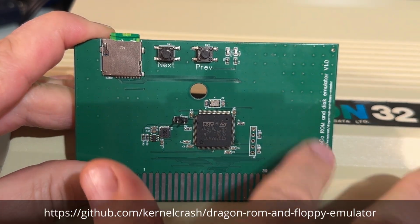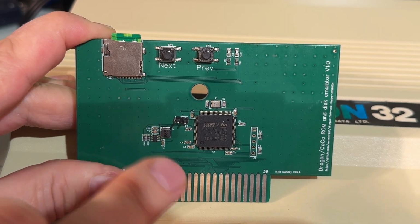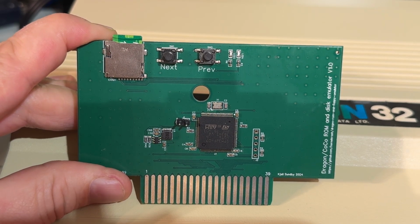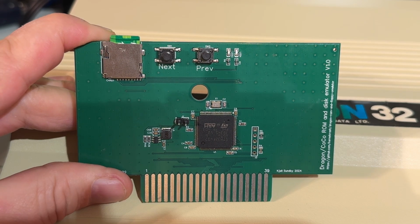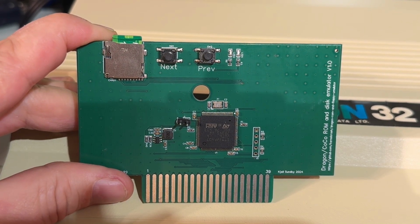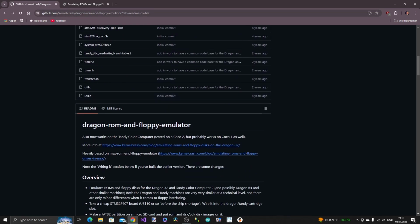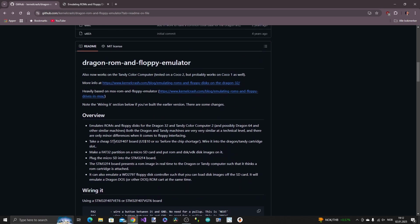However, on this GitHub page mentioned here, I'll link to that in the description, you'll find the actual source code for the firmware that you're going to upload to this chip. This is already done, and I think this header here is just to provide power to this card if you don't want to run it directly from the 5-volt lines of the machine. If you go to the KernalCrash site on GitHub, you'll find information about the Dragon ROM and floppy emulator, and it seems like the latest update was that it now works on the Tandy Color Computer.